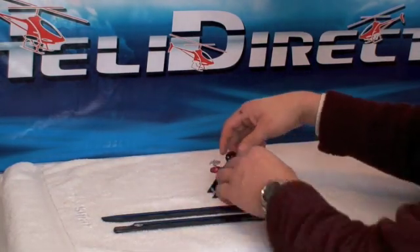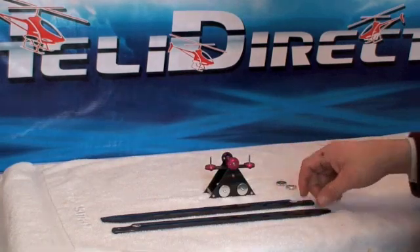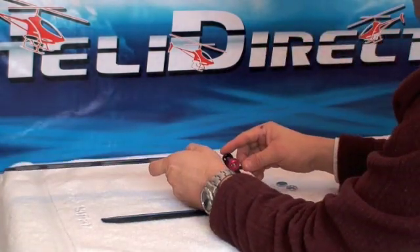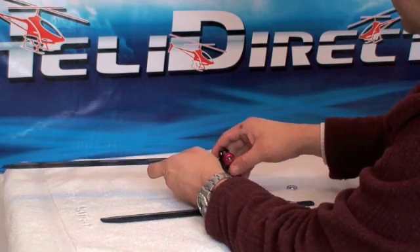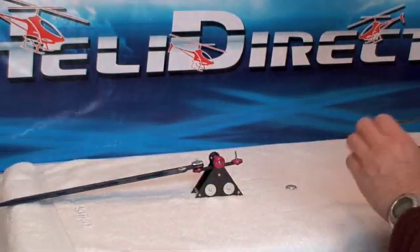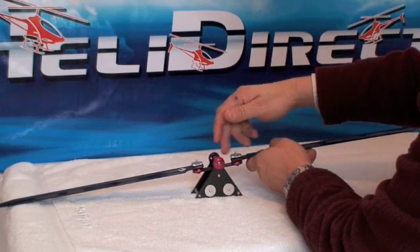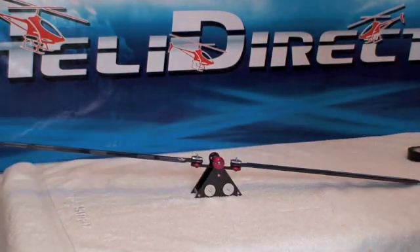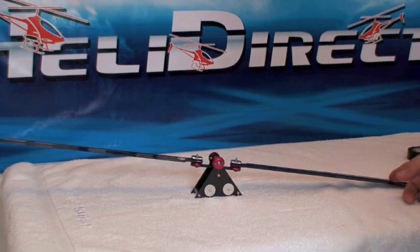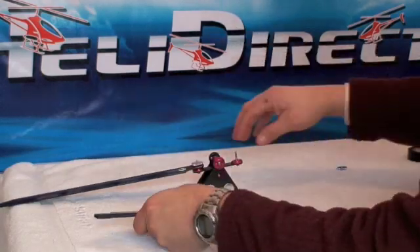The first thing we want to do is go ahead and bolt the blades on to see if we have to do anything. I like putting them on the balancer the way they'd be put on the helicopter — so the left-hand blade's leading edge will be pointed away from me, and the right-hand blade's leading edge will be pointed towards me, as it would be with a clockwise rotating head. Okay, obviously we have one blade that's a little heavy — the blade on the right is the heavy blade. We're going to call it the master blade, so let's take it off first and set it aside.